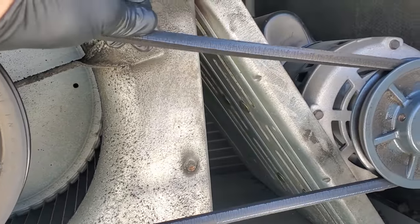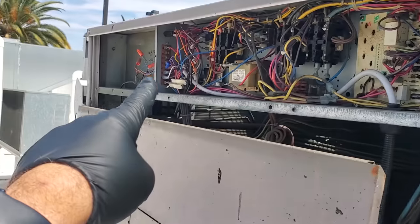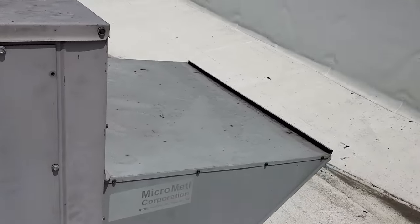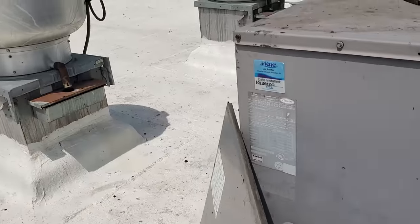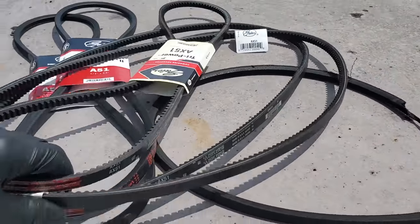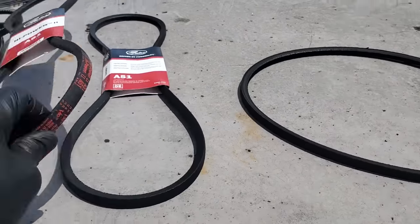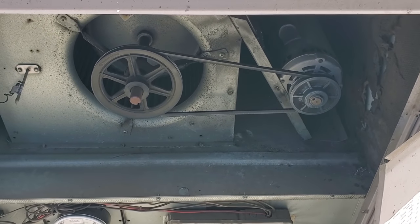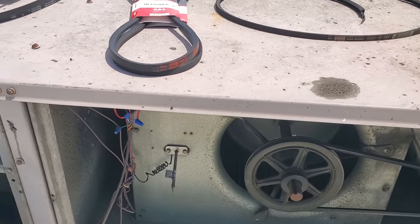I found a really bad used belt in one of the other ACs and threw it on here. Disconnected cooling, left the filter door open on the other side so it would defrost all that ice while I was gone. I've been gone about 45 minutes and I got a bunch of belts — all these units take the same belt. The way I operate is every unit is going to get a new belt because they're all worn out, and then we're going to put two spares. All these restaurants are finally starting up their preventative maintenance programs too, so we're going to slap this belt on and see if there's anything else going on.